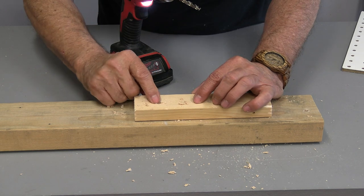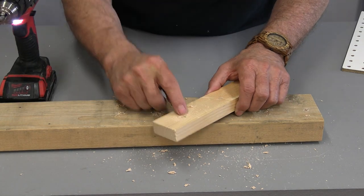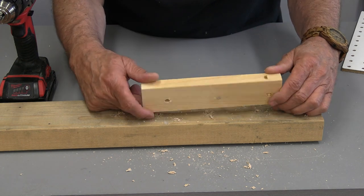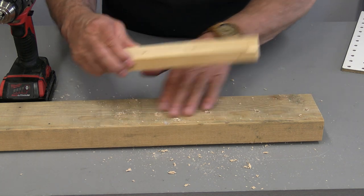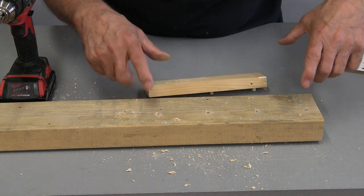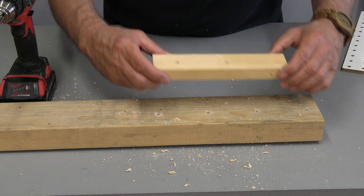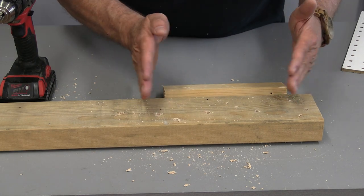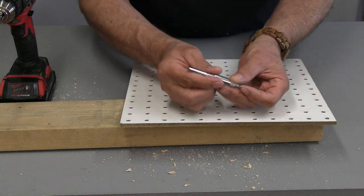Here's the problem with using this jig: I'm using a twist bit, and every time it goes into a piece of wood it makes that hole a little bit bigger. In your first pass you might be okay, but if you're making four of them — say for the inside of a cupboard for adjustable shelving pins — near the end the hole will be so worn that the pins won't align, and your shelves will be wobbling back and forth.